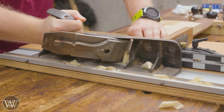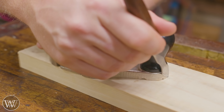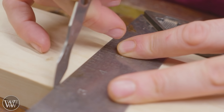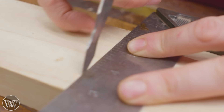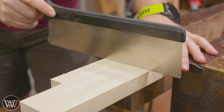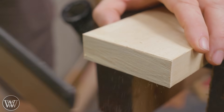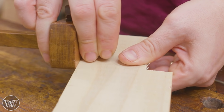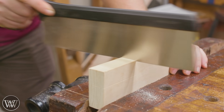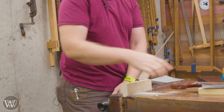First, let's square this up — I've been loving this dedicated shooting board plane. I'm going to make it about the same length as the original router; it really doesn't matter. If you want more registration surface make it longer, if less make it shorter. Then we cut the blank to length — about three and a half inches by one inch thick. Three-quarter inch stock works just as well. I also need to cut a small piece for the back, which is what the iron rests against.